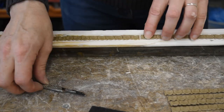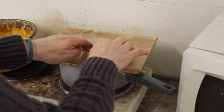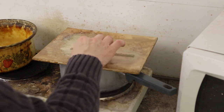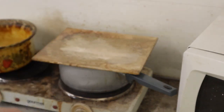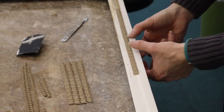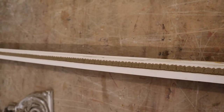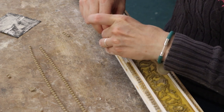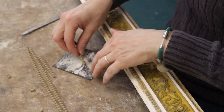Dry fit first — make sure that join is okay. More water. The more time you've left this to dry, the longer this bit will take. But that's about three days and it's only taking a few seconds. As you can see, it's just wetted the back. That's it — no glue needed.